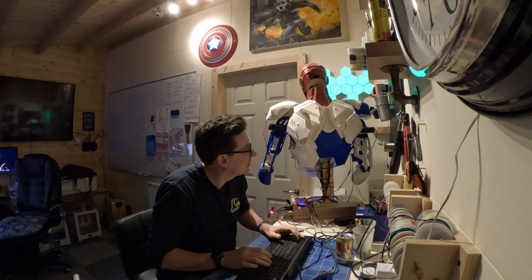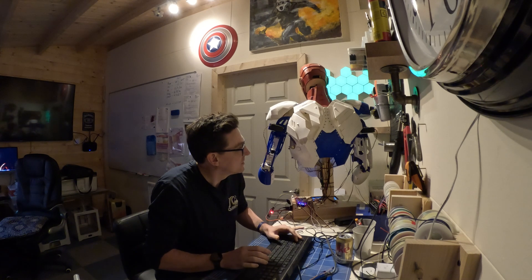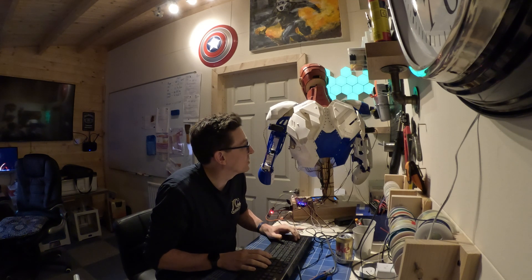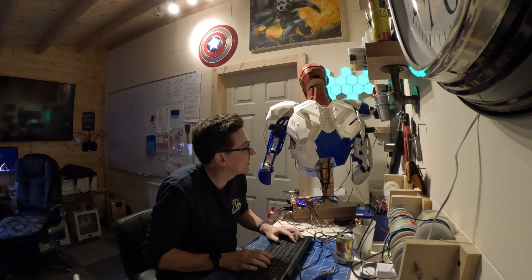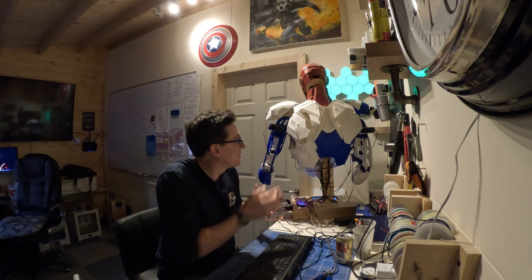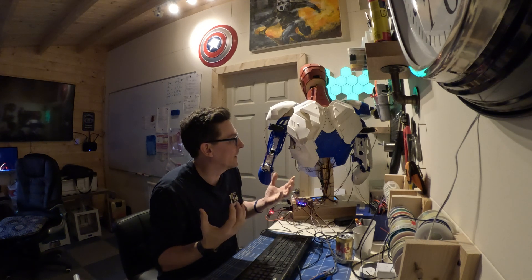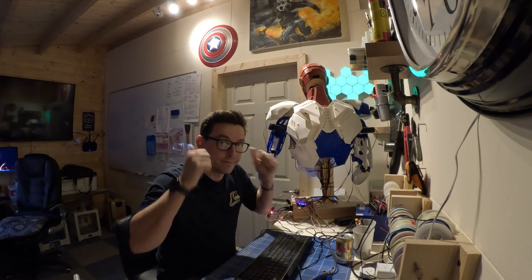Let's put it up a couple more. So that angle is a bit close, and then I can put in the starting angle and see how far I can push it out. So that's the max angle, and the max angle close is that. So I've got to work out where my angles are for each one of these servos because they'll be in slightly different places. Once I've got those angles I can program them into the computer and give them a function like open flap, close flap, and assign that angle to each flap. I can then thread the program so all four flaps open at the same time.